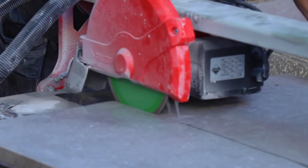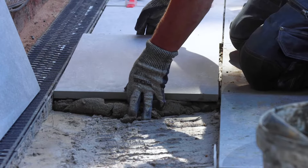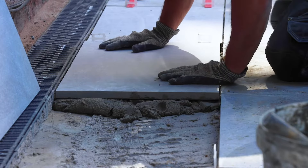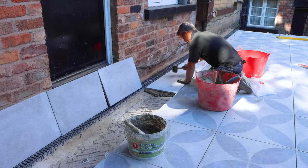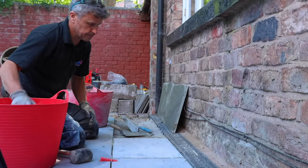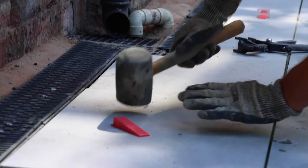Alternatively, you can use a circular saw or a nine inch grinder. Once you've cut a stockpile, you're ready to start installing them. I installed the main slabs down using the rock-tight mortar. So again, once I've done my cuts, I'll stockpile them, then mix up my rock-tight mortar, lay this down, and then of course you'd install these just the way you did with the main slabs.